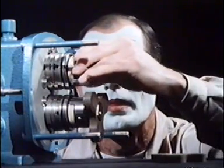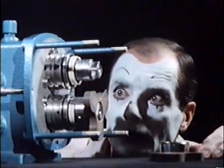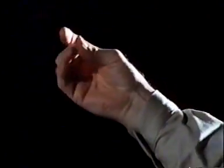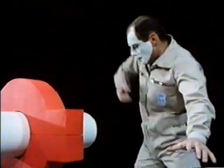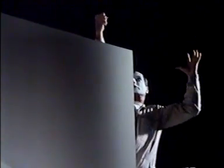This is what a mechanical seal looks like. But how does it work? A housing and a shaft. Fluid is stirred, pumped, centrifuged, or treated in some other way within the housing. It's the shaft that initiates the rotary motion. The gap between the housing and the shaft has to be sealed. That's obvious.